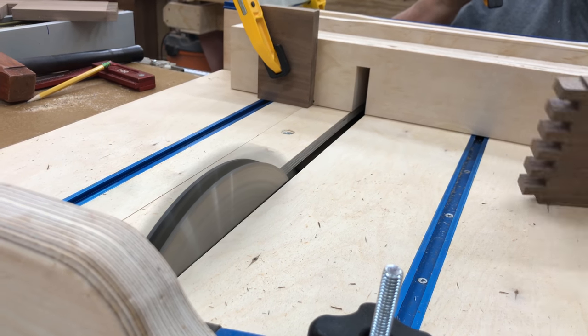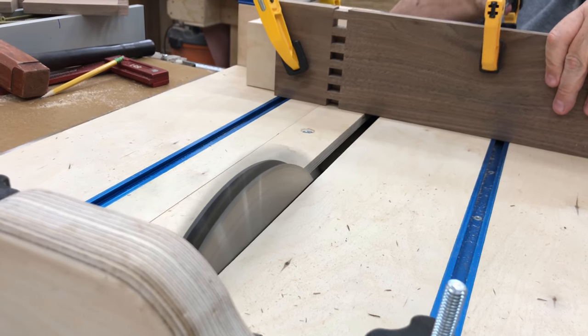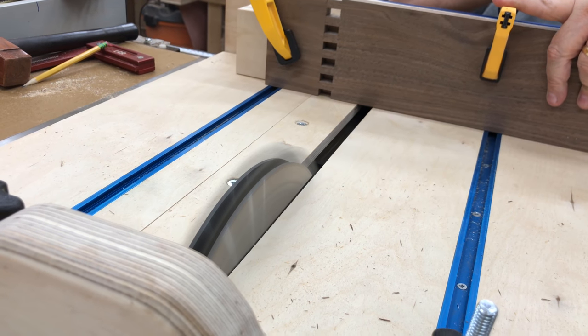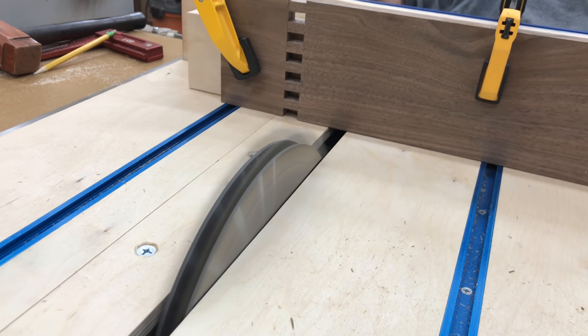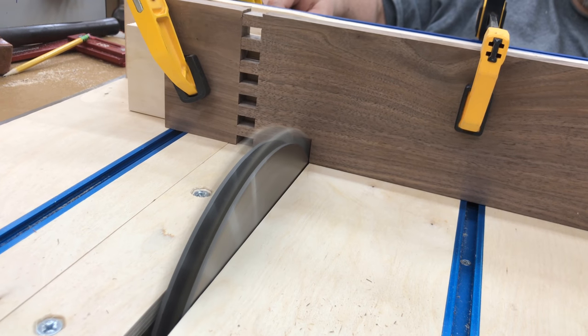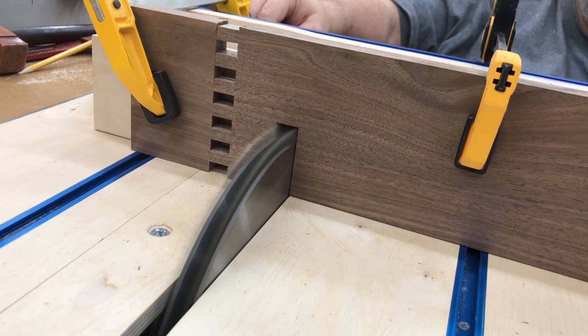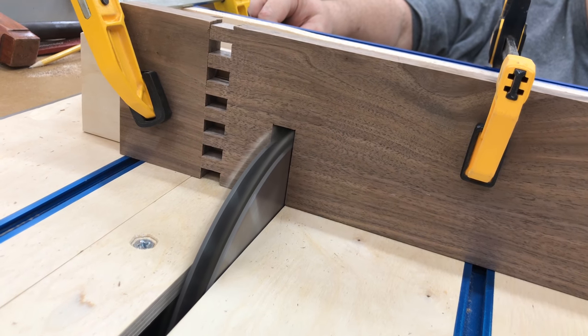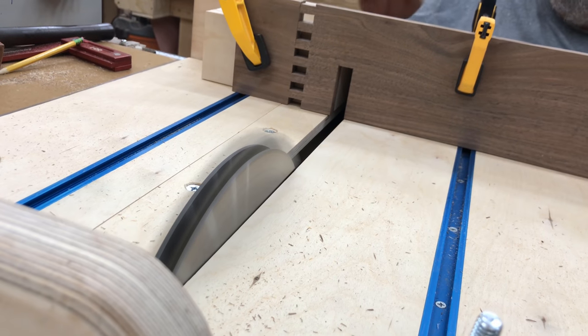If you don't happen to have a crosscut sled, it's something that you should consider building. The crosscut sled that I have here, I created a video for it, and I'll put a link to that in the description as well. This crosscut sled has interchangeable inserts so that I can cut dados, and then when I'm done cutting dados, I can put a different insert in and go back to just using a regular single kerf blade and still have a zero clearance system.